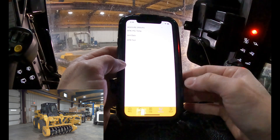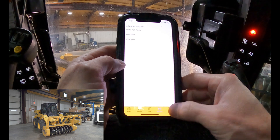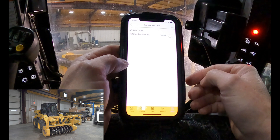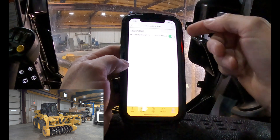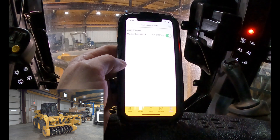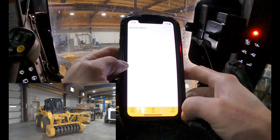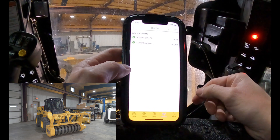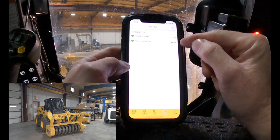Next, we need to find out what this machine has in the way of hydraulic GPM. We go over to Adjust and hit 'Test Machine GPM.' You go from normal mode to run GPM test mode, rev your machine up, and turn on the hydraulics. Then we go back to Measure and it tells us the machine is putting out 39 GPMs. However, we're currently auto synced to 20 GPMs.